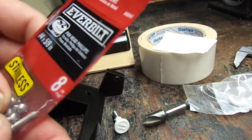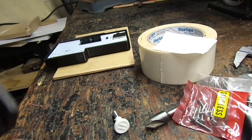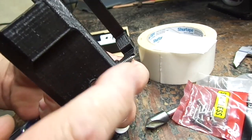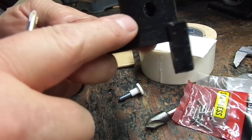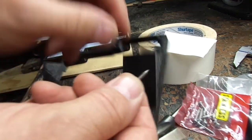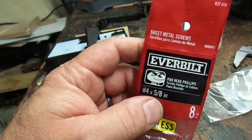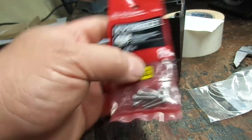If I put a screw through this hole it sticks through half an inch. But if you put the same screw through this other hole, it only sits through a quarter of an inch. The obvious answer is to get a longer screw, but at the home center this is as long as you can get in a number four screw. A one-inch would be perfect but you can't get that in number four. You can order M3 screws on eBay, but we want to do it today.